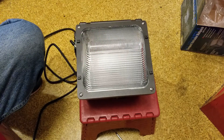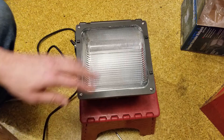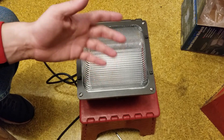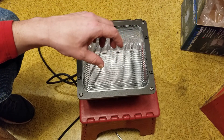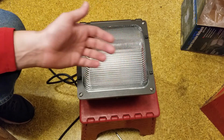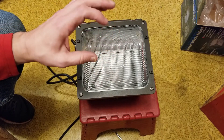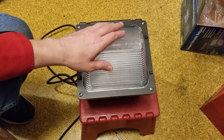Now let's get a close-up look at one of these starting up. These are known as pulse start — they have a little circuit called an igniter that does a high voltage jump between the two contacts inside the bulb to get an initial arc going. That's why they flash and are dim when they start: it's just a basic arc at first. Then little bits of metal inside the bulb begin to melt and vaporize as the arc heats them. That vapor enters the plasma beam, increases its conductivity allowing more energy to flow, and the particles themselves emit light — which is why it slowly gets brighter as the salts fully melt and vaporize. After the initial high voltage spark, the igniter turns off and the bulb runs in the 200–250 volt range.